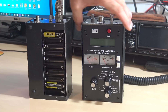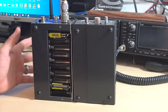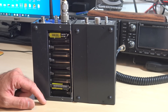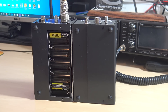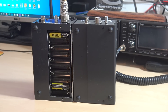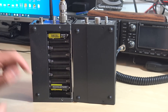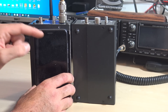On the back, they both use the same type of batteries — double-As. Mine's supposed to have a cover; I lost it. But here's my idea: having eight double-As, I usually use rechargeables. My buddy Eric Seaman sent me a bag of them with solar chargers. But sometimes you just want a long life. My idea is to use something like this Bioenno 12-volt lithium polymer battery. I'm going to find one that fits in the back and run the cord right into the 12-volt input on top. It lasts months and I can unplug it and put it on a charger. That's my idea.